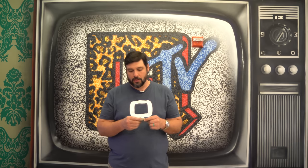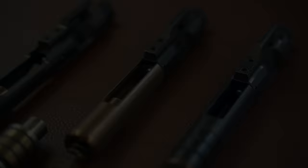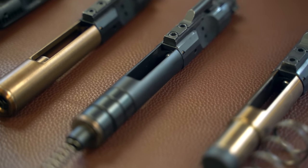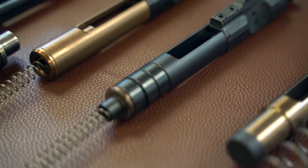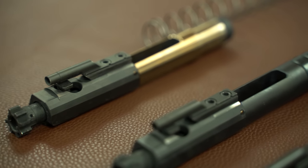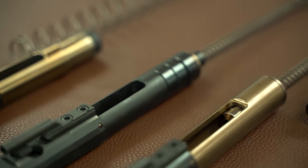We don't have a lot of room, so we have to do that in a much shorter length. We figured it out actually three or four different ways: with a singular exterior weight, up to three exterior weights, with rubber bumpers in between those weights. All of those systems work pretty well to mitigate bolt bounce, but they are timing-based systems.